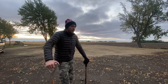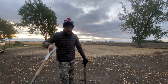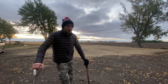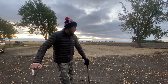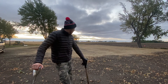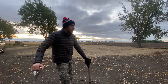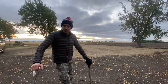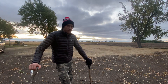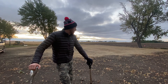We're getting right up on go time. This weekend I was hoping they'd have the electrical transformer put in, but they don't. I brought down all the components for temporary power, and I'll be marking out the distance we need for our URD — the underground electrical conductors that will be trenched from the transformer to the house. Also marking out for the LP lines to go underground, figuring out where our septic hookup is, and maybe digging down to expose it. It's kind of a staging weekend.